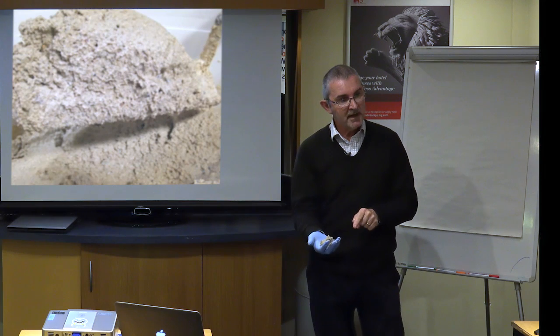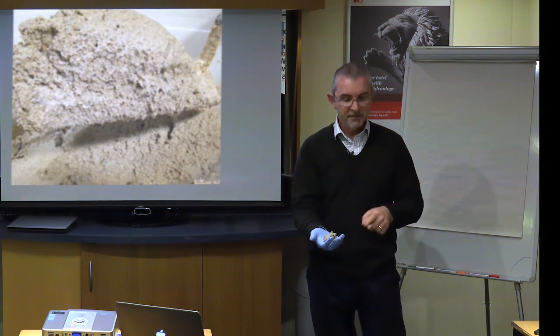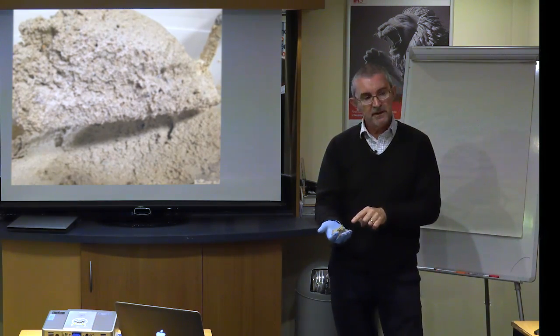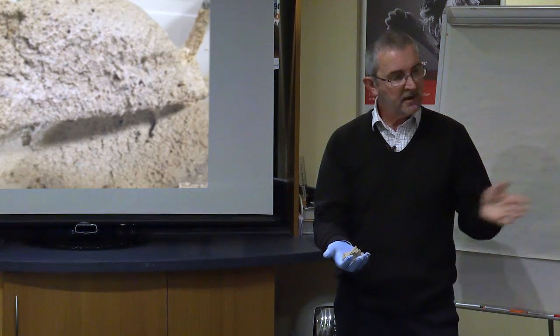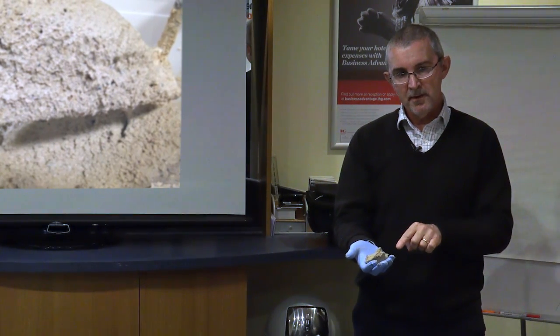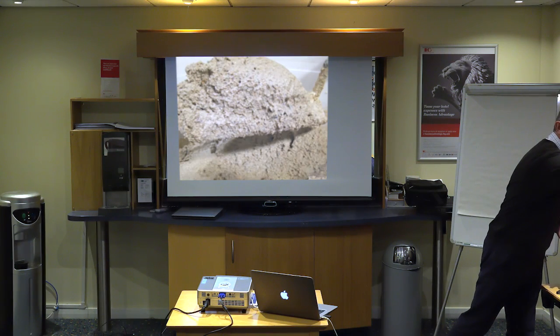If you mixed up a cement mortar in your barrow or whatever, it will go off. This is one of the beauties of non-hydraulic limes, okay? As long as they are kept airtight, you can keep using it. I could keep this for 10 years. So this is a 2.5-year-old lime mortar that I've been using, and I've kept in this airtight container when I don't need it. And it will always remain soft like this. You can see it's completely fragile.